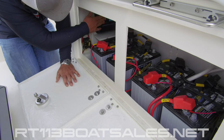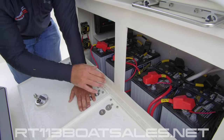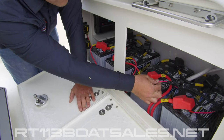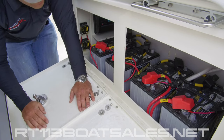Up here, we have our battery charger for all four batteries on the boat. There's a plug on the outside leaning post — you plug it in and it charges the batteries. Each wire has a fuse on it. These little wires are your charge wires. If any of the batteries stop charging, be sure to check the fuse inside of that case and make sure it has not tripped.